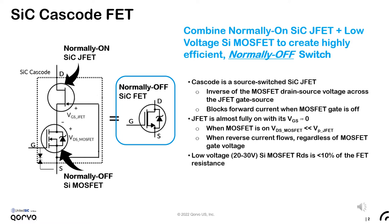In the third quadrant, reverse current flows regardless of the MOSFET gate voltage. Therefore, the structure has an excellent integral diode made up of the low knee voltage of the silicon body diode in series with the low on-resistance of the silicon carbide JFET. When the MOS channel is turned on during reverse conduction, the forward drop is further reduced, and the reverse current easily flows through the switch's low on-resistance, bypassing the 0.7-volt silicon knee voltage.